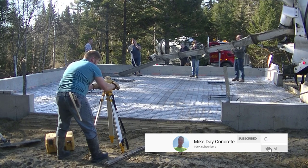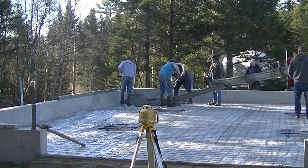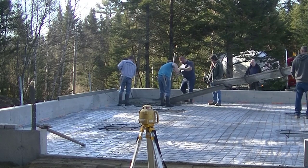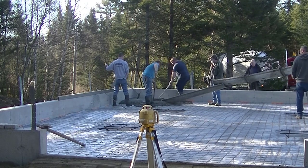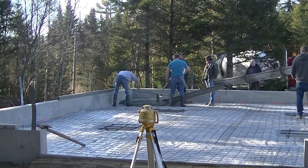He's also got four posts set in the middle of this floor. You can see the holes he's got dug for the footings for those beams, and then a little matter of rebar we put over it. We put down a 6-mil poly vapor barrier and the wire mesh — that's what the spec called for, so we're going to pull that wire up as we go.